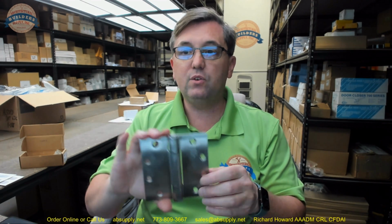It also tells us the weight of the door, meaning what's the performance envelope of a hinge that is 4.5 inches tall. It depends on the volume of use. It depends on the thickness of the hinge as well. And I'm going to pull up a chart that will allow me to give you an idea of what weight range based on door volume, what weight of the door, and what sort of usage is happening on the door. So we have here a 4.5 inch tall by 4.5 inch wide heavyweight hinge. Discounting the base material, which I can't tell you if it plays a significant role at all, I doubt that it does. Steel versus stainless versus brass or bronze.